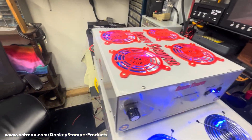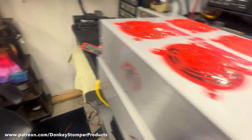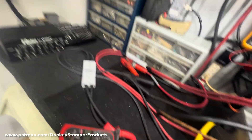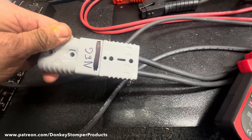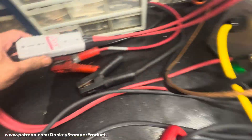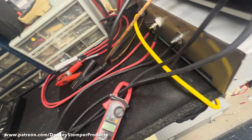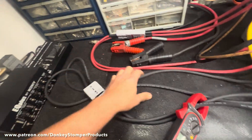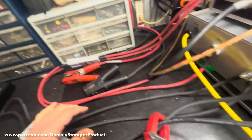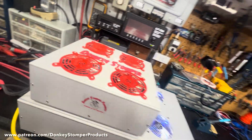She's all powered up and turned on. I want to show you something — it does have thermal protection, and I did print that on there. The Anderson connectors aren't wired the normal way you'd normally use them. One set is negative and they're marked, so it's impossible to get them wrong — that's why I wrote it on there. Normally red is positive and black is negative, but I did them the other way so the wires wouldn't tangle across each other. I did two wires because I was afraid one Anderson connector wasn't going to carry the current, so I put two of them on there.